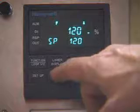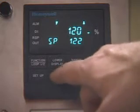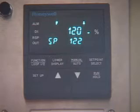If no automatic control is being used, we recommend that the operator use a Delmhorst Model C2000 digital moisture meter to occasionally check bale moisture. He should also observe press hydraulic pressure, as this is a good indicator of Humidaire performance. Water temperature may then be changed manually to achieve the desired results.